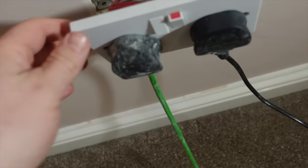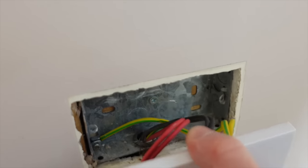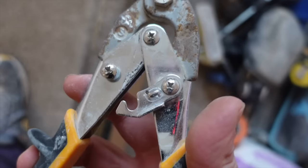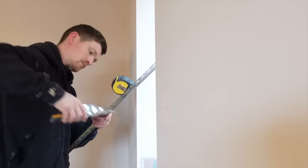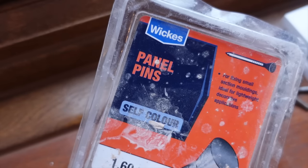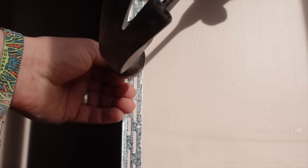Obviously I'm a plasterer, and I know I'm going to be wasting a lot of time, because look, here's what we've got to do just to prepare our walls for plastering. Got to undo all the plug sockets. Got to fix corner beads to the windows. The walls with PVA.